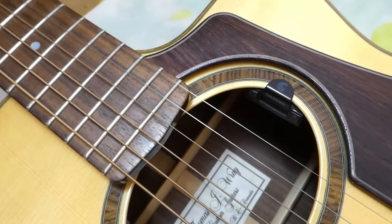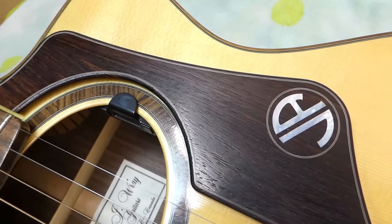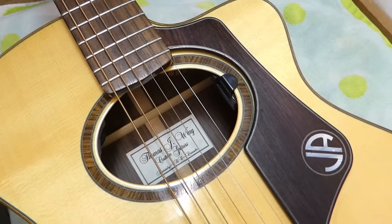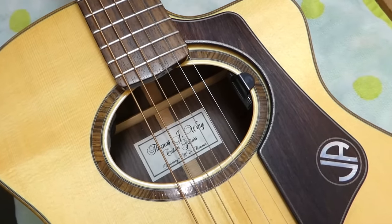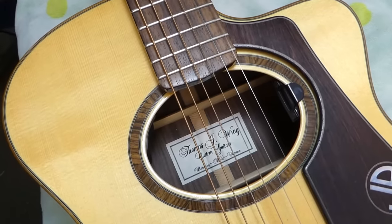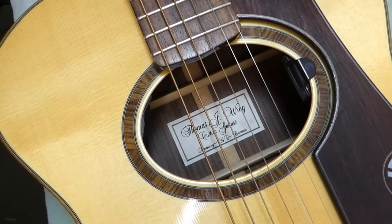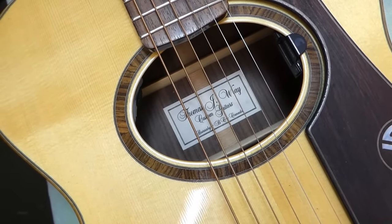Take a second to appreciate some of this fine line purfling around the pickguard slash finger rest and this really lovely oval sound hole. Now in the days before CNC, cutting an oval sound hole - or more specifically the channel for the rosette - was always a bit of a trick. There are some router jigs you could come up with that revolve around two pivot points, but most often it was just make the thing, then scribe it and cut it out by hand. That's good work.